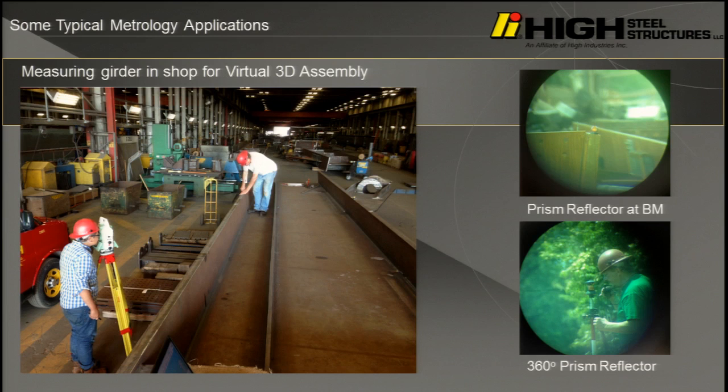What's your survey tolerance in the field? With a transit level or total station? I could be asking you these questions and not give you the PDH code at the end of them. What's the survey tolerance for shots, elevations, and bearings, nearest what? 1/100 of a foot, which is about 1/8 of an inch, right? Okay, good. I'm talking, so I guess I'll just continue then.